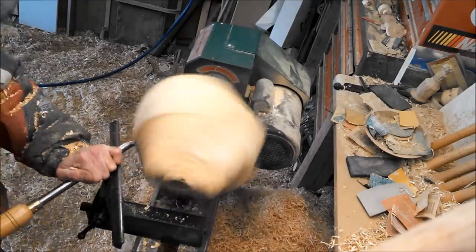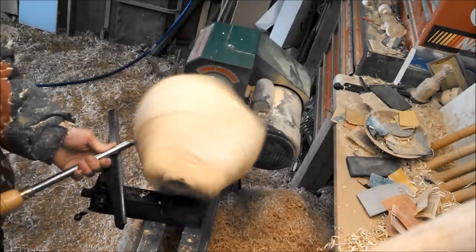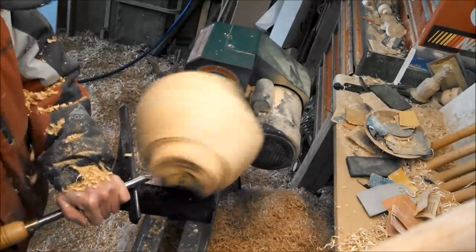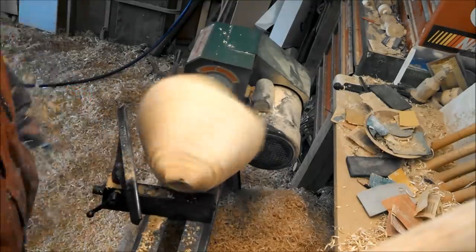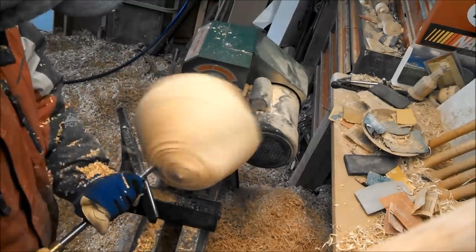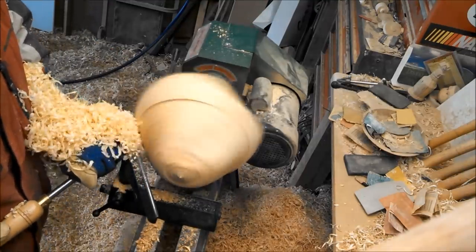When I started this turning, I had a general idea of the shape I was going after. I started by hogging off the bulk of the wood, and then I made a mounting tenon, and continued with push cuts until there were no more flat spots.